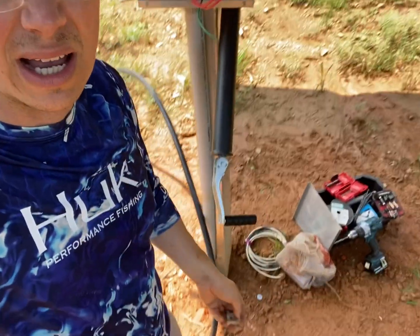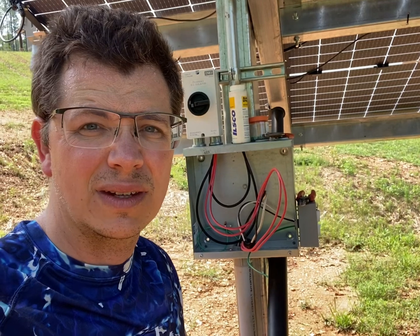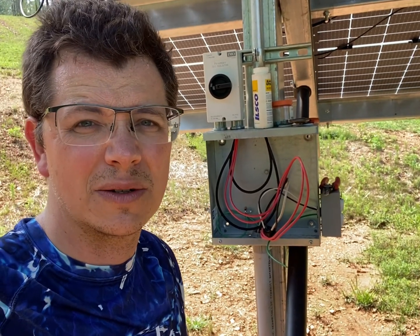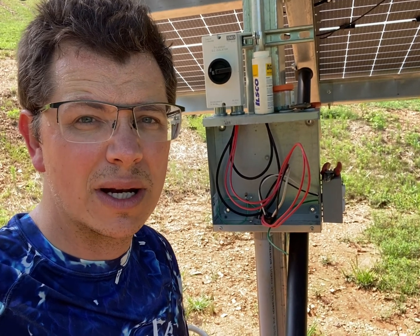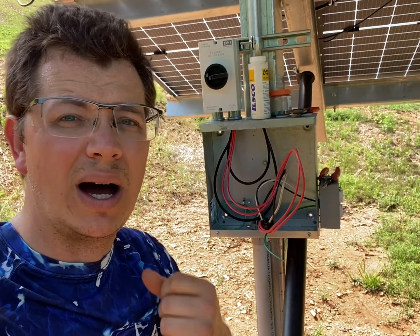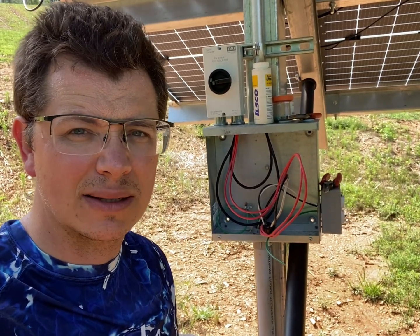On this system I have driven posts — I've got seven feet of galvanized C-channel in the ground — so I really don't have to do a ground rod. You're not required to do a ground rod at a ground-mounted solar array, but it is important that everything is bonded electrically and at some point all of it ties back to the system.